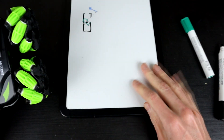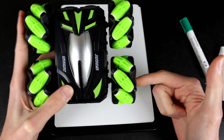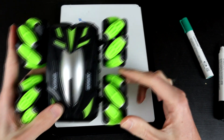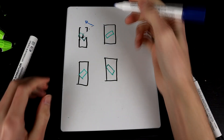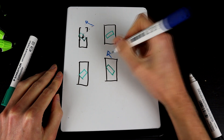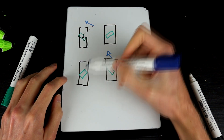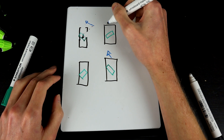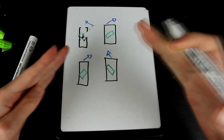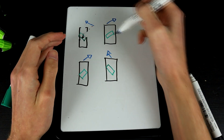But what happens if we want to go forwards and backwards? As you can probably see, driving one wheel forwards doesn't actually get the robot to go forwards — it forces the robot off at an angle. So we've got some diagonal force from this wheel and also from this wheel, calculated in exactly the same way, and then we've got force from both of the other wheels, but because of the direction of their rollers we actually get force in the opposite diagonal direction.